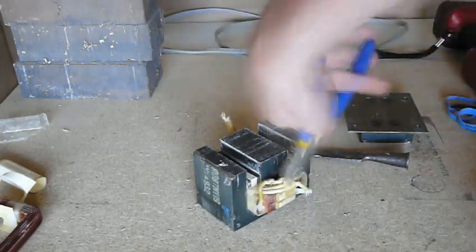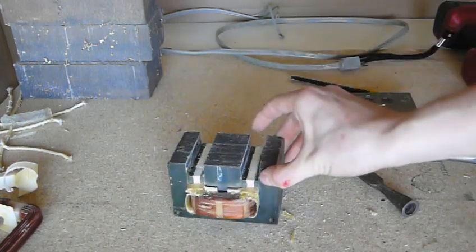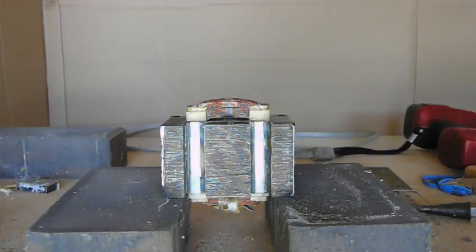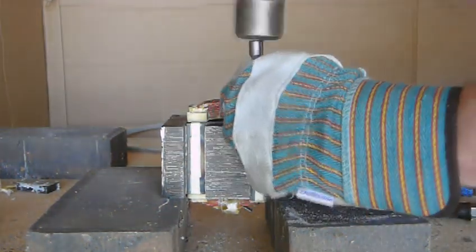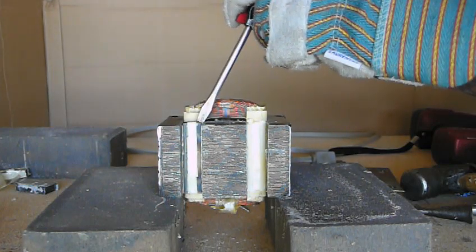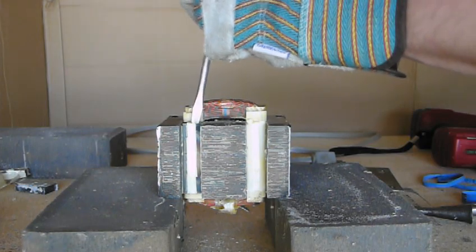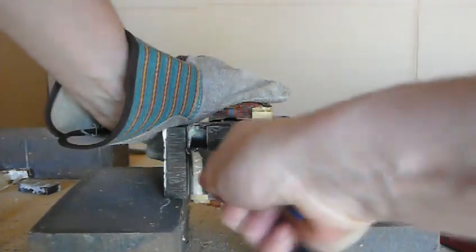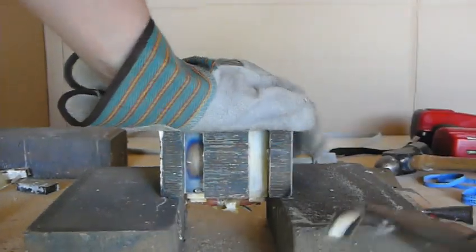Next you'll want to get rid of the middle coil. It's not that hard — just cut it and rip it out, or you can unthread it. Next you'll need to get rid of the magnetic shunts. They're just a stack of laminations held in there — they pop out and look like small flat pieces. The easy way is to support the core between two bricks or two 2x4s, get something to use as a punch, and while the varnish is still hot it'll just slide right out. If they're stubborn, grab a flat screwdriver and chip away two or three layers until they're bent and separated, then grab a pair of pliers and twist and rip, pulling off two or three layers at a time. There are some situations where you want to keep the magnetic shunts in, but in most cases you want them gone because they limit the current.